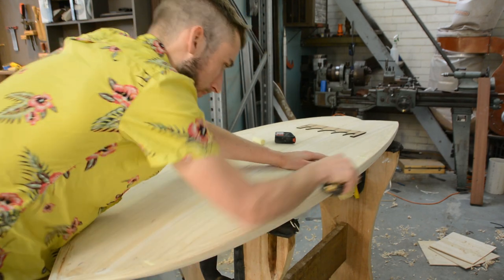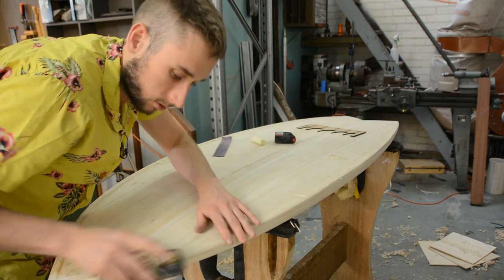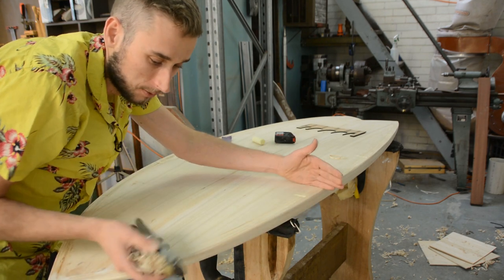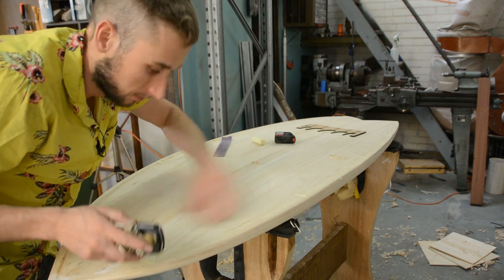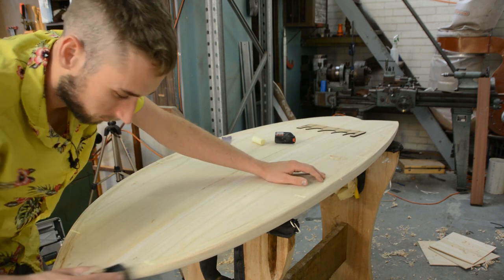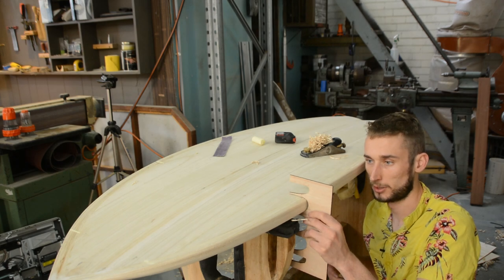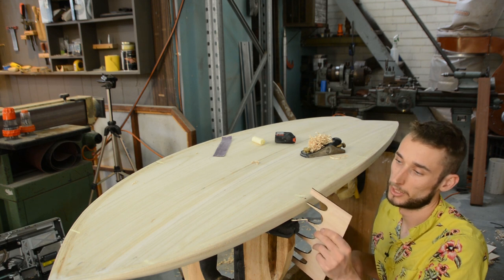It's not really a uniform curve up here so it's not going to take continuous shavings from one end to the other — you're really going to work in sections. Right now we're working in a section about 450 mil or close to two feet, and then we'll jump forward and work on the next section until everything's faired in. At 1300 we're really close, we just need to work it down a little bit further.